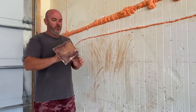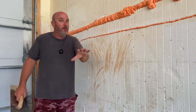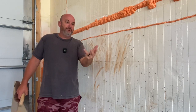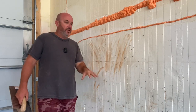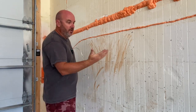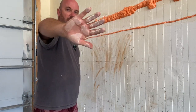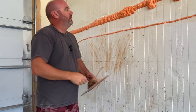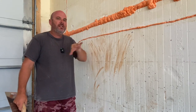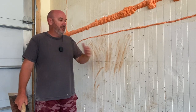So this rasp is really slick. I'll just show you — I'm on the garage today, but it would work the same in a pool to prep it for base coat, skin microplaster, whatever. ICF that's been out in the elements for any period of time — you've probably seen me do this before — if you put your hand on it, you can see that it gets kind of chalky. The surface gets broken down by the sun. Also pollen and dust and everything else accumulates on the surface and it makes it where nothing will stick.